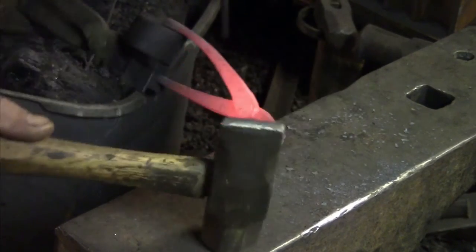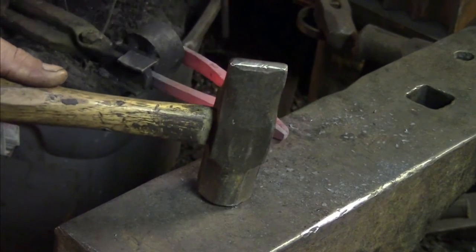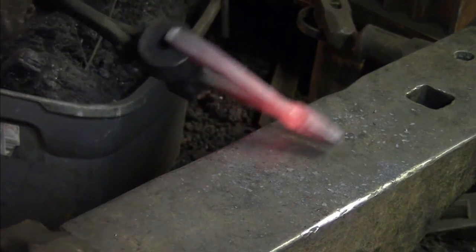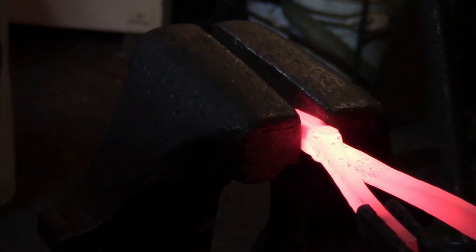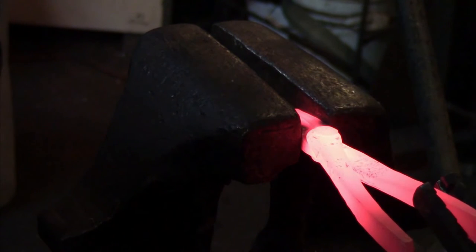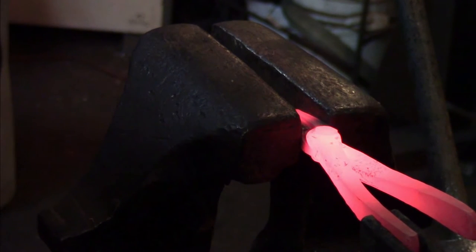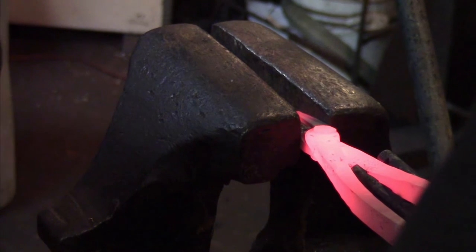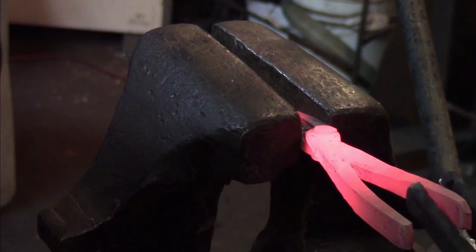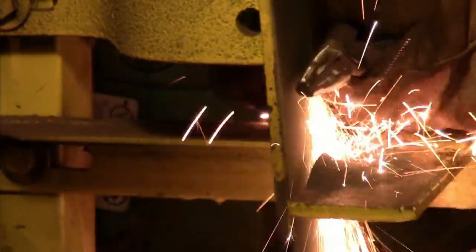One of the first things I did was make wider handles, so you could put more force on the handle and it would be spread out over a larger part of your hand — so it wouldn't dig in — and would effectively give you more power at the jaws. I started to polish the handles so you would have much less friction on your hands. Friction is what leads to blisters, and polished handles significantly reduced them.